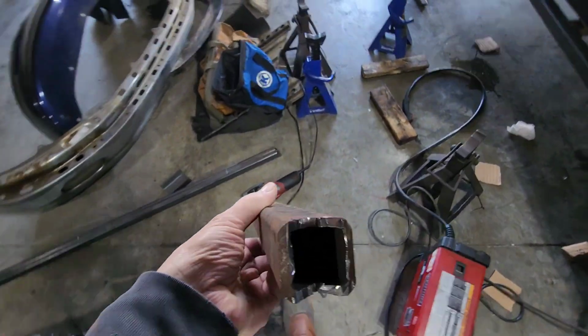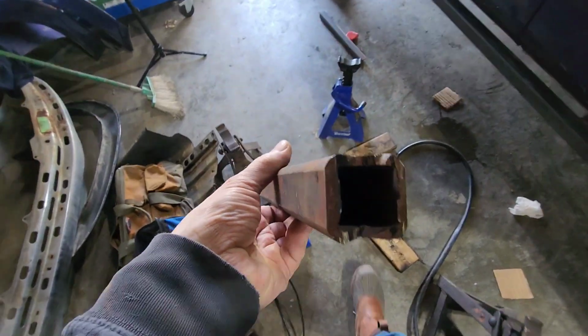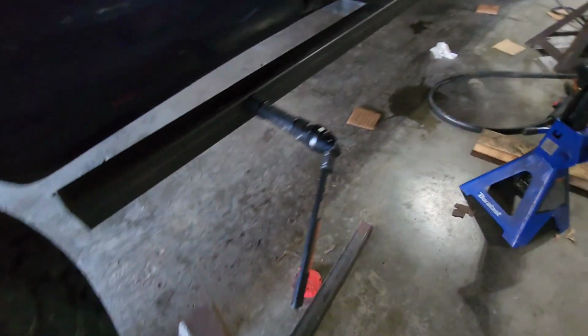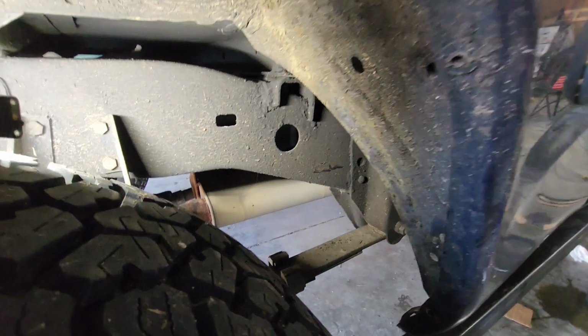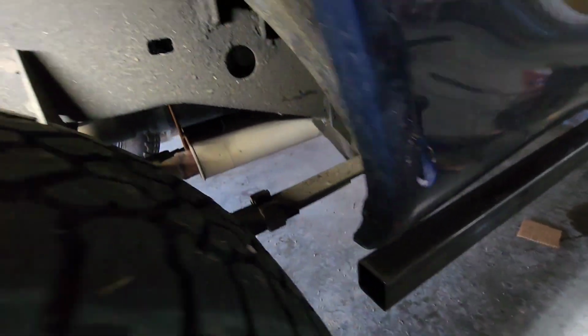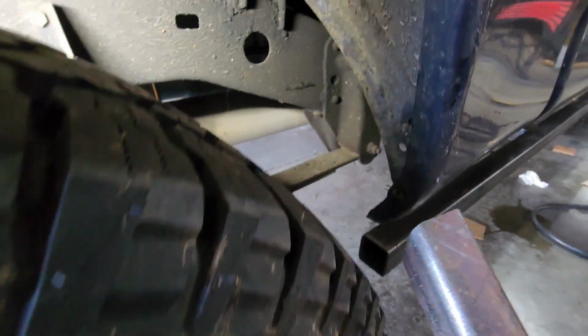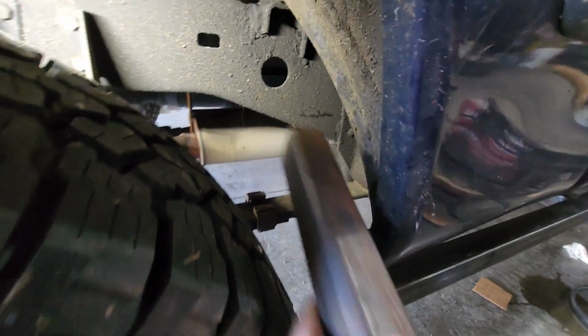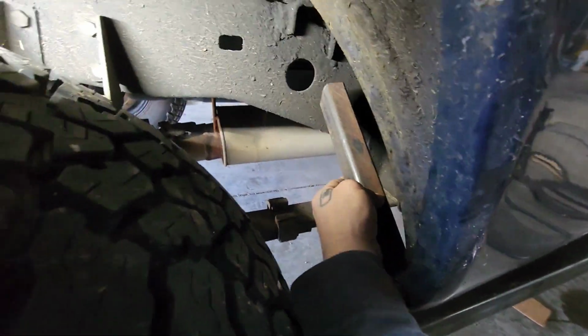This is actually 1/4 inch or 3/16 inch thick stuff here, and it's a smaller diameter, but back here, that's just all the fluid film and dirt and stuff on my frame. I had to grind all that off, and you'll feel or hear all the fluid film inside your frame boiling. Don't forget to reapply.